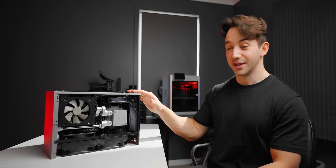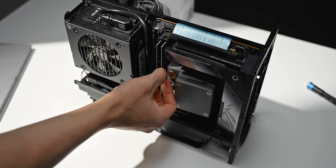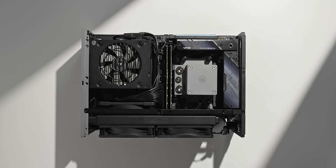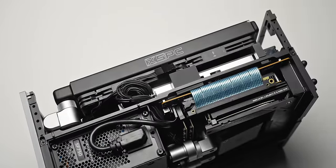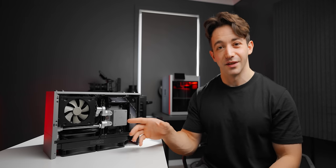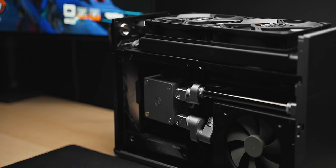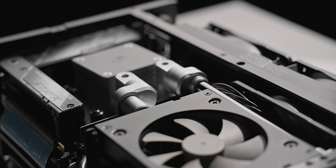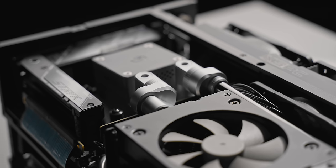In my last video, we had basically finished this build up until the tubing and the fittings, but that was definitely the hardest part. We had already filled this PC case to the brim without those tubings and fittings in there. So to make this work, I knew I would have to use some pretty specific and special fittings from EK. They're not sponsoring this build — every single fitting and tubing has been bought — but this build is simply impossible without some of these very specific fittings. These low profile 90 degree fittings, for example, I've used two of these directly on the CPU block and without these, the side panel just would not close.